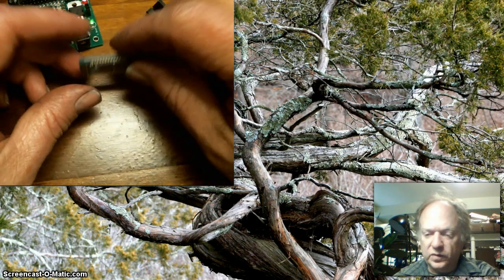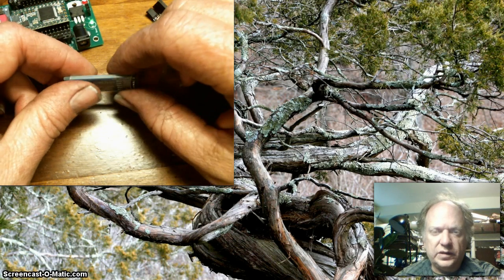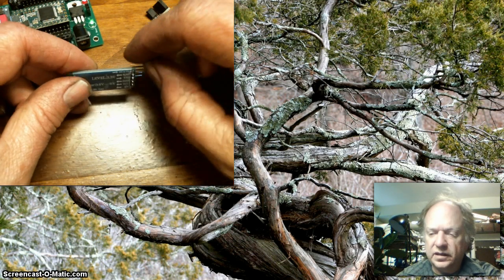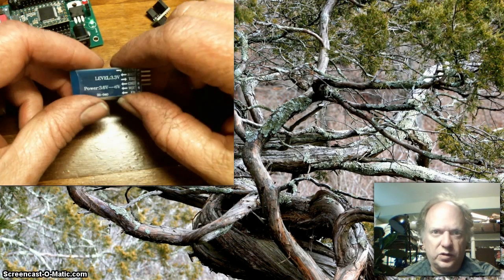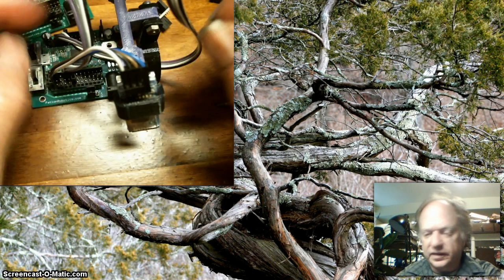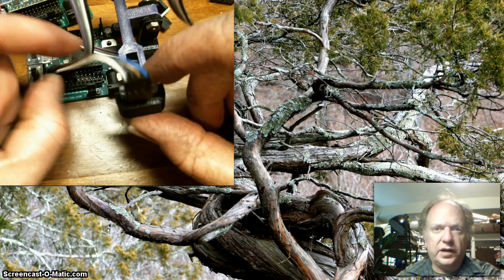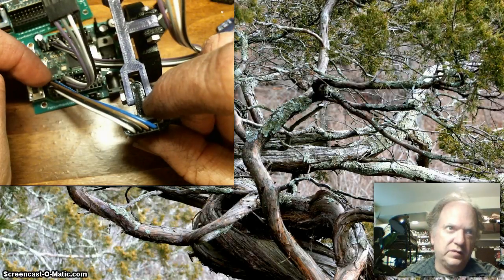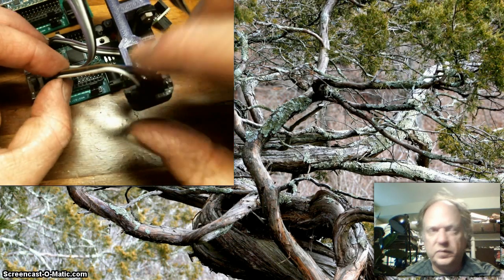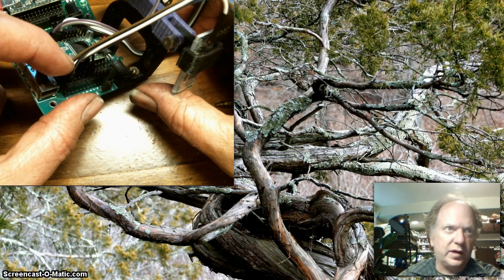You can wire them up a couple of different ways and control them a couple of different ways. You can either just wire them directly like I've done in this particular case. Here you can see the blue and the brown wires going down to the transmit and receive of this TNC 3.2, and the white and black wires going up to power and ground, with the black wire on the outermost pins being ground and the white wire being power.